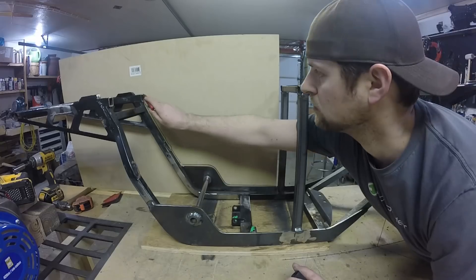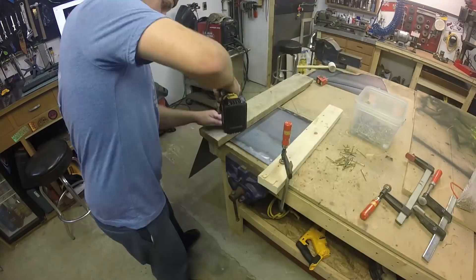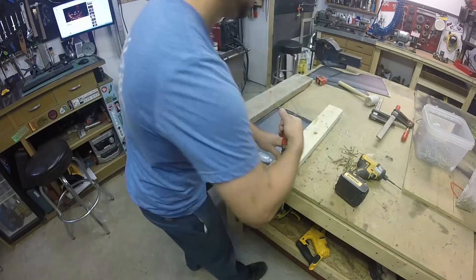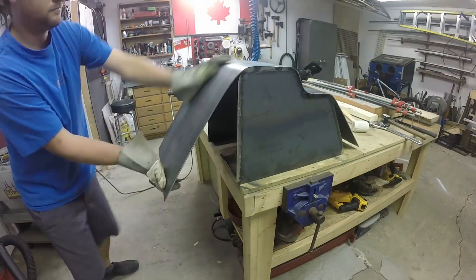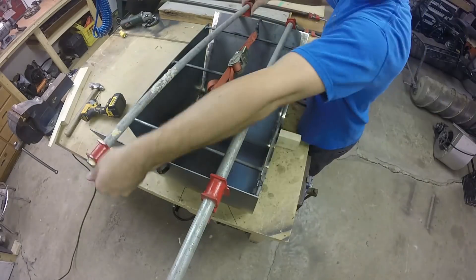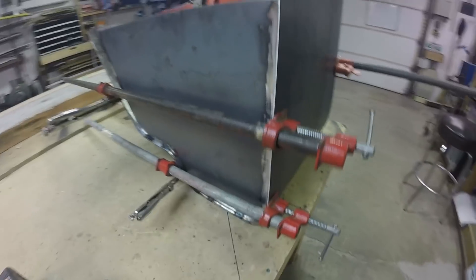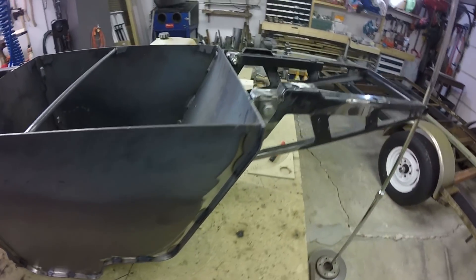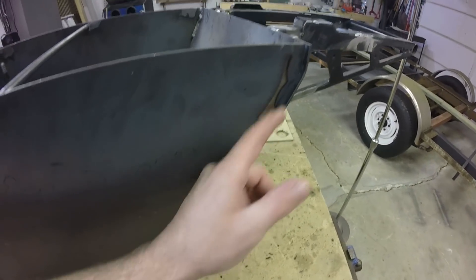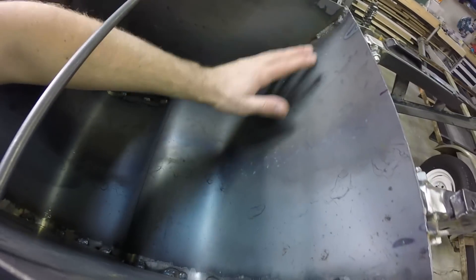I started making the tank by just building a template, then plasma cutting the sides out of that. The whole tank is made out of eighth inch plate steel, and I bent everything by hand using the workbench and clamps and pieces of wood and anything I could come across. Once I got it kind of fitting, I used some rod to keep everything separated and just worked my way along with different clamps and straps, bending it by hand and tack welding along on the inside. After I had it all formed up, I left about a quarter inch overlap all the way to the outside — that's where I'll actually weld the tank to seal it, and I'll fill it with water to make sure it doesn't leak. These inside welds are just for bending and getting it all together.